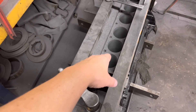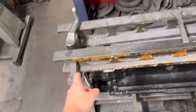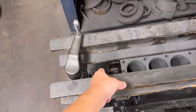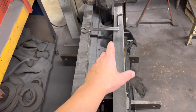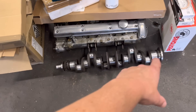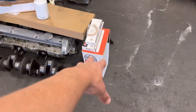The early Jaguar block — we've had to bore that to plus 60 as mentioned in the previous video. I've just finished the last bore, so we'll get it off the boring bar, over to the hone, and finish honing it. The customer has sent the end plate — the timing chain cover — which must be fitted and the block faced with it on, as it's dowelled. We'll face it first, then hone, to avoid covering the block in honing oil before facing. John has ground the crank; we've ordered the bearings, thrusts, and plus-60 pistons.